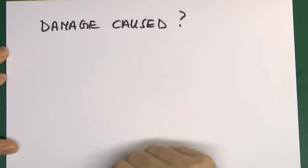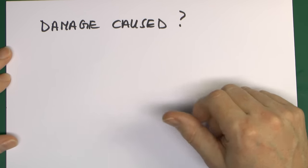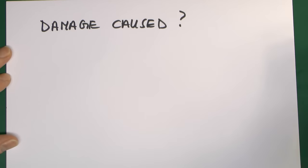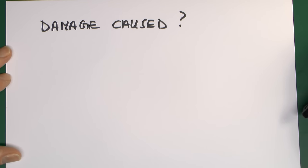As I said before, surges like this have existed pretty much the whole time that electricity has been in use — lightning strikes have been around for millions of years — and surge protection in itself isn't particularly new either. So why is it that suddenly it seems to be a big thing? The answer is that until fairly recently, most of what was in a typical installation wasn't actually going to be really affected by transient overvoltages, or if it was, it didn't really cause a big problem.